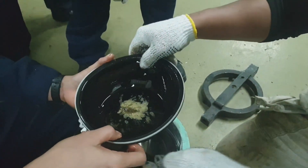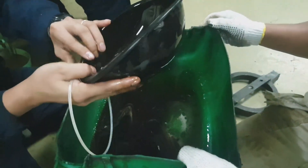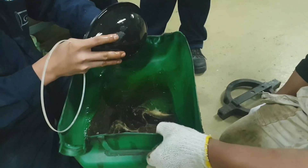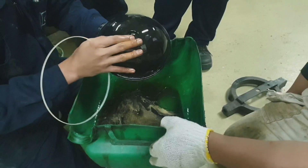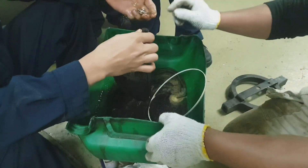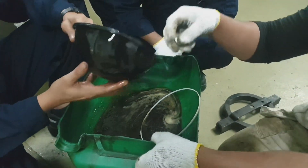Take note — you have to observe how it looks. There is a backup ring of the membrane. As you can see, the lower part or bottom part of the accumulator is badly damaged. In this case, we cannot use the old accumulator, so it is necessary to replace it with new spares.